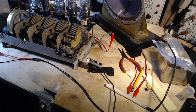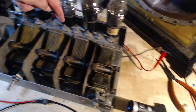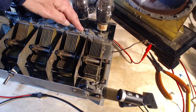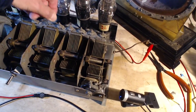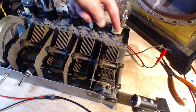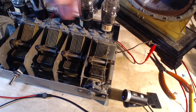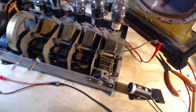Got some adjustments here that I'm not ready to play around with yet. All these adjustments here are little mechanical capacitors, right out in front of you. They're not contained at all. The dielectric is sitting right here, and you just squeeze down or loosen up, just like any trimmer, really. Probably consider these the early versions of capacitor trimmers. A lot of this has to do with neutralizing this circuit and stuff I'm not that familiar with, so I'm not ready to fiddle with these yet.